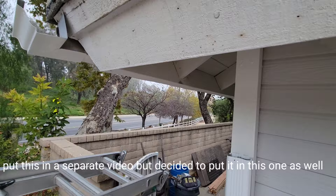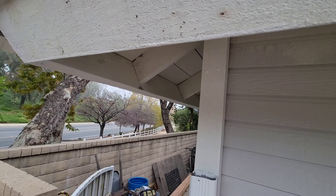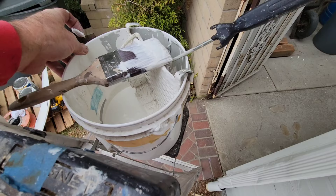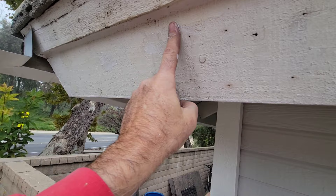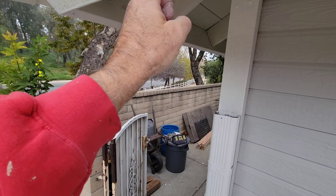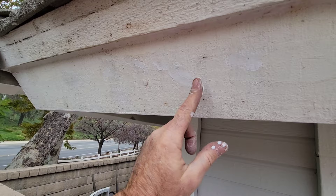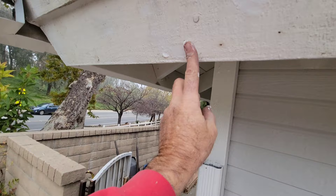Knocking out a little fascia board — I'll show you a little trick I've been doing for years. I just don't even think about showing it because it's second nature. I've got my caulking right next to the handle of my bucket. I always put whatever patch I'm using right next to the bucket handle. For exterior work, the best patch is caulking. Some of you guys are patching all your holes in advance, going through patching every hole then painting — that takes a lot of time because you're going up on a ladder twice. I don't do it that way.